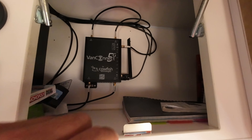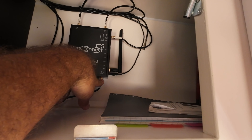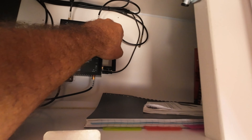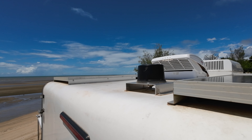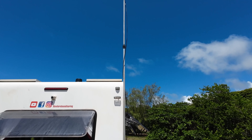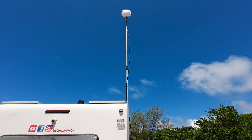The way we've got it connected up now is we have the Omni antenna coming into both ports. It's got 4 internal antennas with 4 cables coming from that unit, plus the internal aerial, and it has an external aerial in the Omni antenna. You'll get better reception outside with an external antenna compared to a unit that does not have that external antenna. Currently we have our panel antenna set up outside on the pole in a temporary position — normally it's on the front of the van in a mount, but for testing we've just got it down the back of the van.